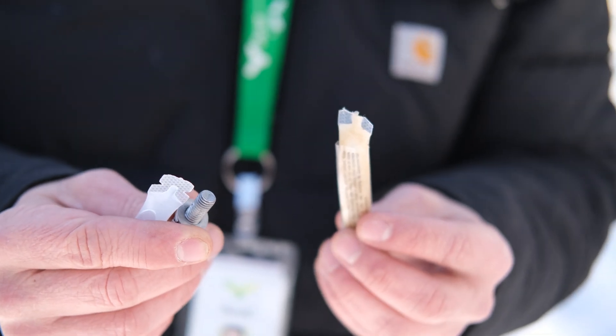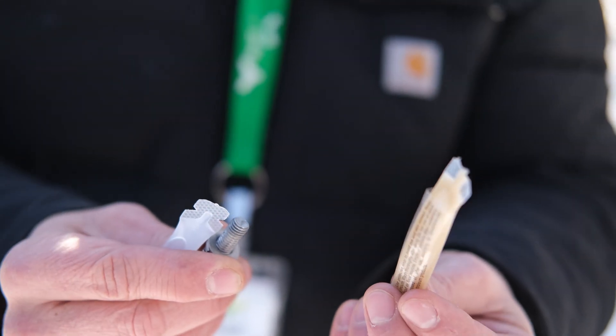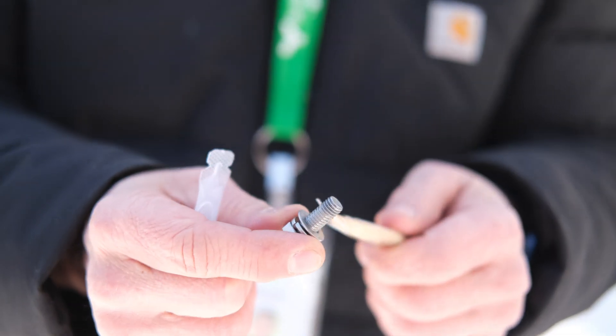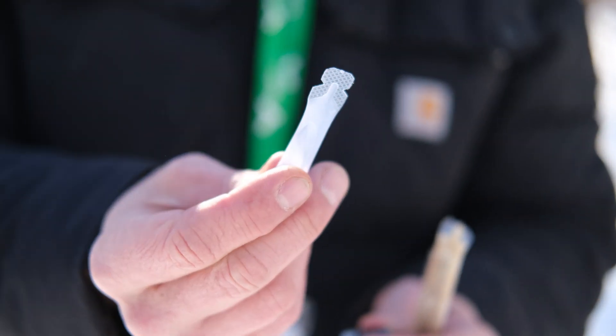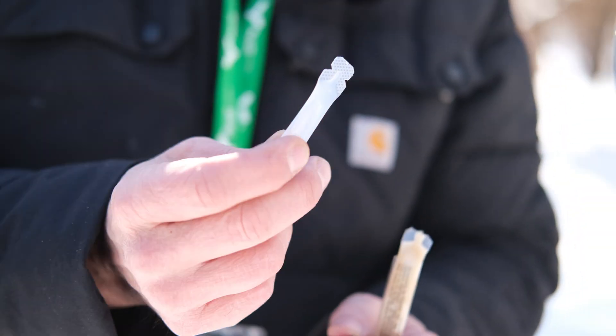In the box with the antenna, you're going to find two tubes of silicone grease — a clear one and a brown one. The brown one is used for all of the threads on our nuts and bolts, so you're going to want to apply this to all of these threads before we assemble the antenna. The clear tube is used for the O-rings; we're going to put this on all of the O-ring gaskets as we assemble our antenna.